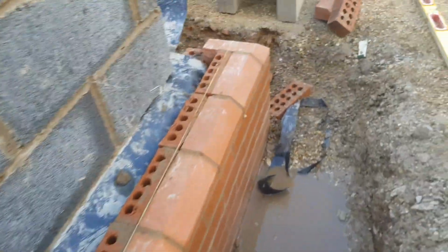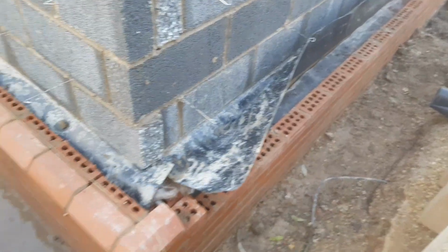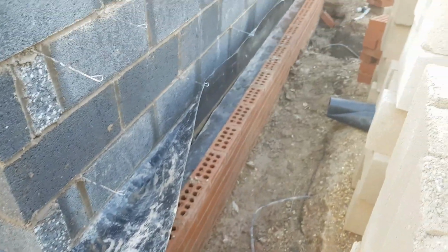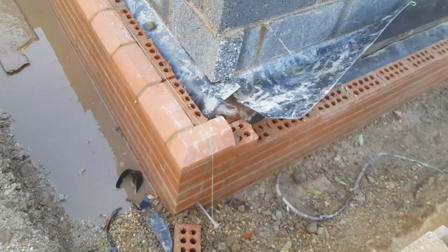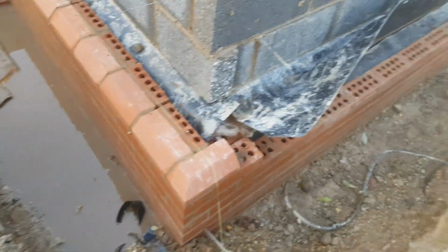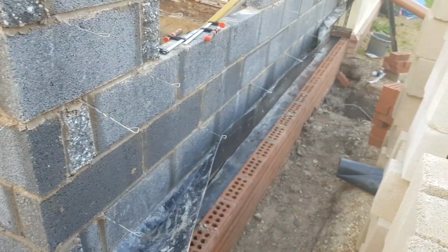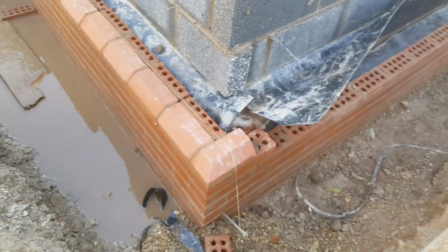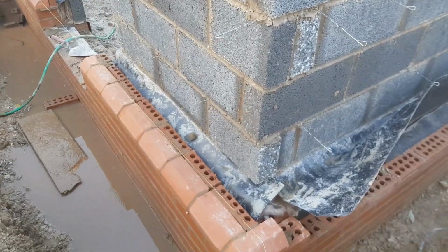And finished all this front, and now we're going to be just going down this last side here. Done a load more 50mm cuts for the back, so final push and get this done today. Don't look like I've done loads, but it's five courses in total, because I've got that and then three behind, three slithers. And it's about 70 bricks in total, this job. So it is quite a few bricks, but it just don't look like I've done much. I was trying to explain to the customer. But either way, we're getting there.